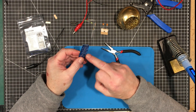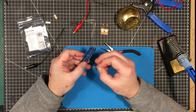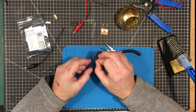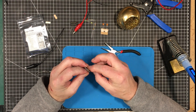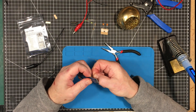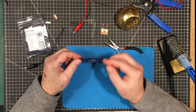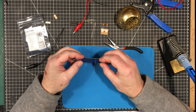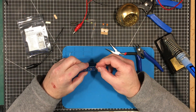Another thing I should point out is that the spacing on the resistor wires really sucks — the spacing between the pads is less than the natural spacing on the resistor, so you have to bend the wires so hard that damage may occur. I think that's a little bit of a failing; they had lots of room to give it an extra 0.1 of an inch.